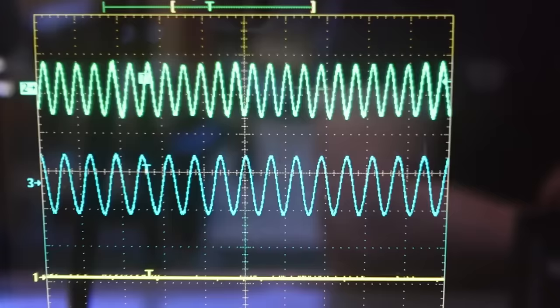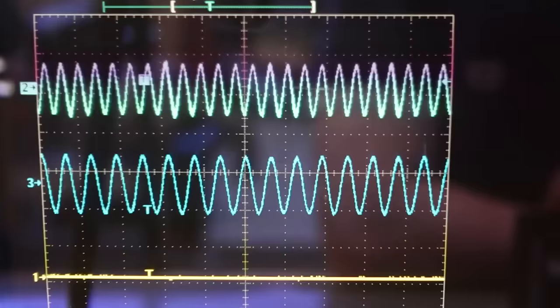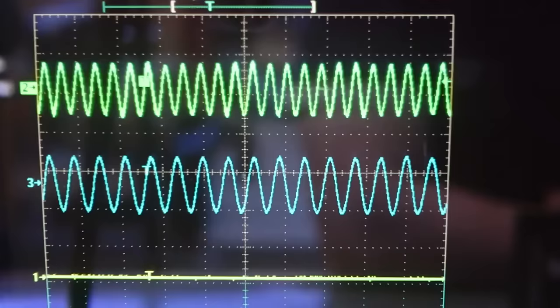And there you can see the left and right waveforms. There appears to be a little bit of modulation you can see, which I would agree with, very low frequencies, about 7Hz and 9Hz. Supposedly 7Hz on the left channel, which is the blue line, 9Hz on the right, which is the green.